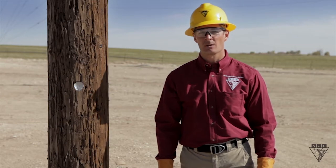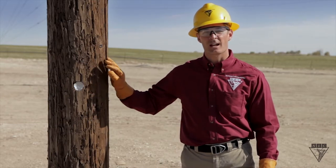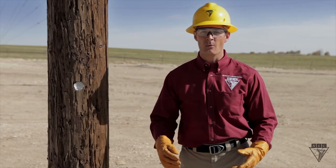Also, be aware if you're pulling the pole, because setting the rigging too low can make it top heavy. So the next time you get ready to do some work on an existing pole, check the brand and make sure it's not too high above ground. And as always, test the pole to make sure it's safe to climb.